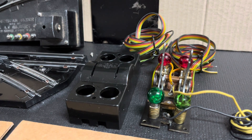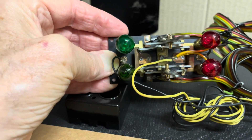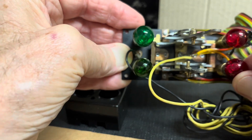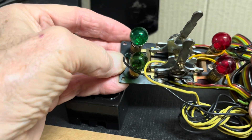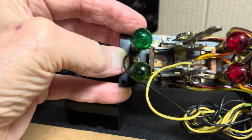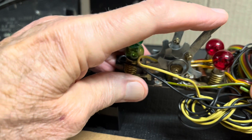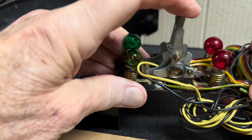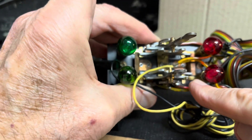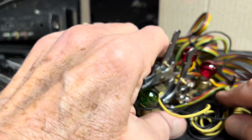Most of the work is involved in cleaning this device. I do wash it — I don't submerge it — I remove the bulbs, wash it thoroughly, and then alcohol wipe and polish all contact points and surfaces within the controller. If there is not good movement in the lever, I will lubricate it with CRC 2-26. So there's a lot of tedious polishing, cleaning, and alcohol wiping in this area, and maybe even adjusting the tension on the springs just a little bit.